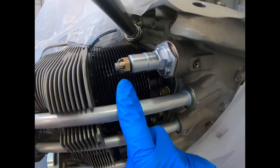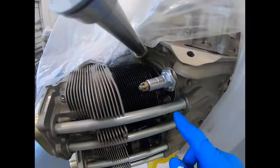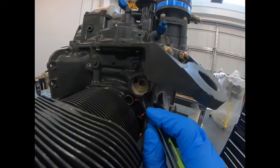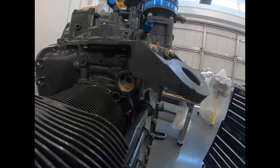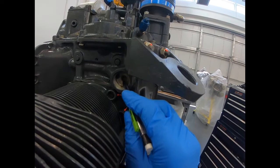On the O-540, the one that comes from the factory, there's no outside adjustment — you would have to change the adjustment by adding washers on the inside. Looking inside that cavity, the hole in the center is oil fed in from the oil pump and filtration, then it goes into the gallery.